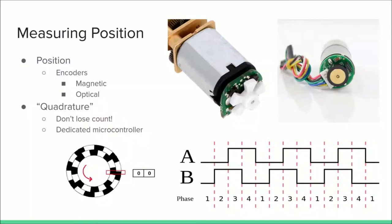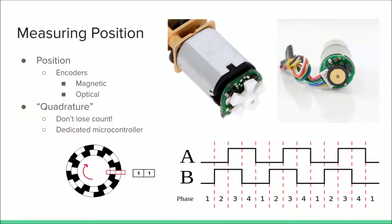So how do you measure stuff? These pictures show a couple of motors with encoders attached. The one on the left is a Pololu micro metal gear motor, as used to be sold by Pimoroni — they're about to sell a magnetic encoder version instead. That has a slotted disc at the back and two photo transistors. The one on the right is a Pololu 25mm gear motor with an encoder — the kind used in WALL-E and TigerBot. That has a hall effect sensor and a magnet attached to the output shaft. The magnet spins and the hall effect sensor detects the motion and gives you pulses. That one gives you 48 counts per revolution, and then through a gearbox — a 21:1 ratio — you get around 980 counts per revolution, which is a reasonable number.